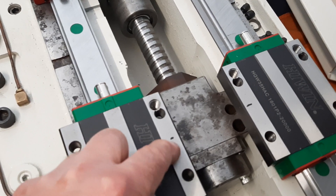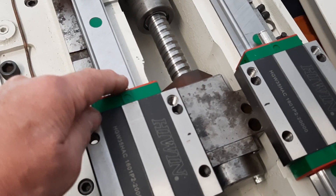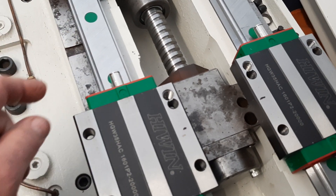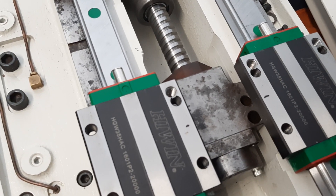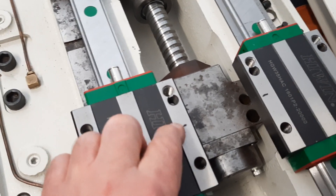The NSK is porting through the top - so they're just feeding through the top, then they cross drill to the centre, and then they're drilled to one end. So they're actually still feeding from the end but they're actually fed from the top, not from the side. With the Hiwin units they just feed straight in from the side. Much more easier. This porting's a pain in the ass.